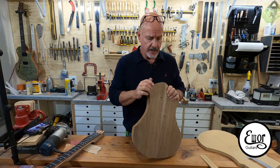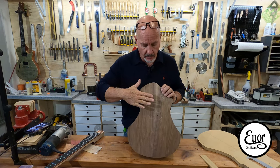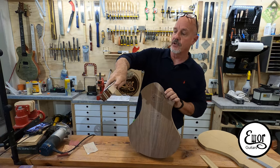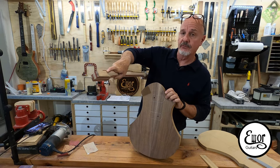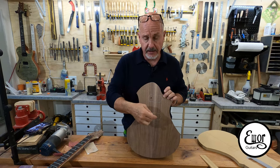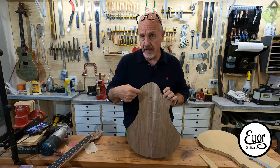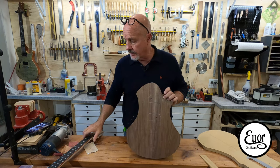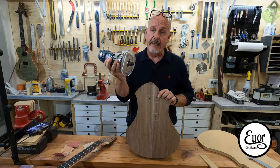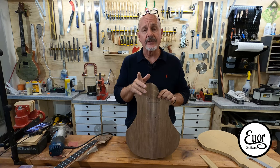I want to go ahead and route in for my bindings. I want to cut the neck pocket, which if you remember is going to be on an angle. I also want to bevel off the top portion of this guitar at the same three degree angle, so along the edge of the fretboard we have a nice even reveal where the fretboard is basically going to sit right on top of the body. I want to cut the pickup pockets, and I also want to drill the five holes for our controls — our two volumes, two tones, and our three-way switch. I think the first thing we're going to do is get out this little router. I've already got the proper bearing set up to do the double binding — the red heart and the maple binding. So let's start with routing the binding.